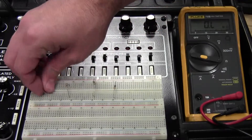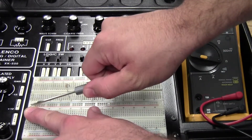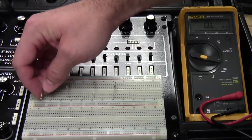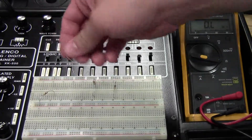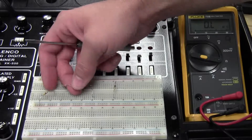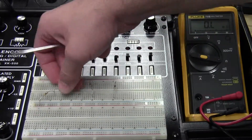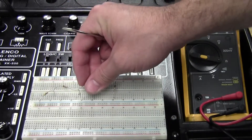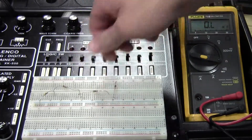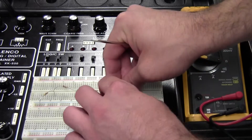In order to build the circuit, I'll start the first 470 ohm resistor out in the positive spot, because when I put power to the circuit this whole row will be 12 volts. I'll plug that in and run it over to one of the rows. The second resistor has to be in the same row going this direction so that they're connected electrically. I run the second 100 ohm resistor over to another row — it doesn't matter which row. The only thing that matters is that the next 510 ohm resistor is still in the same row going this way, and then run the 510 down to another row.